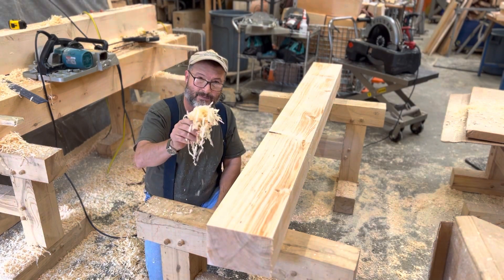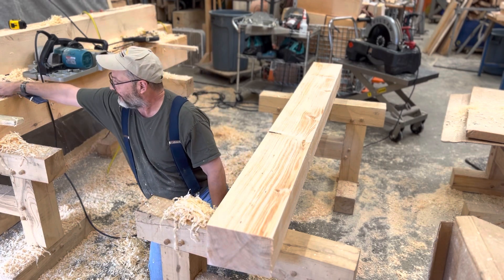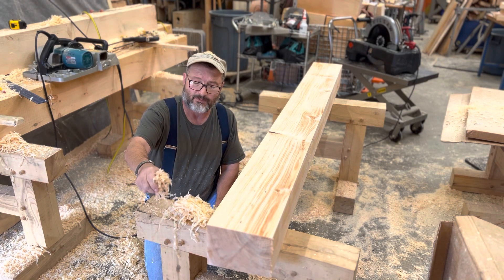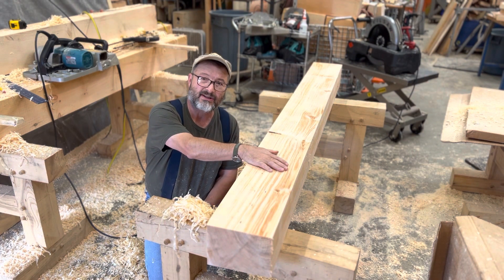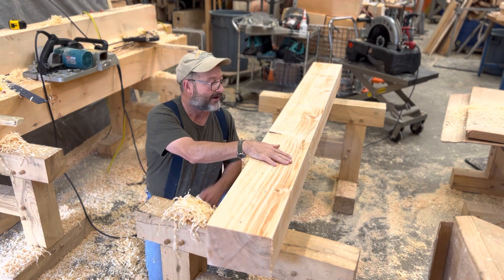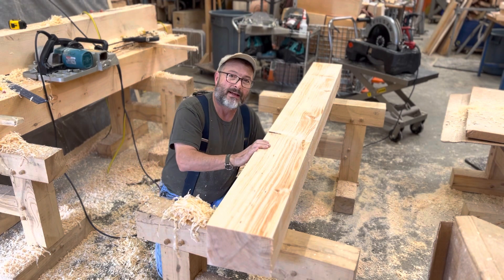This is the size chips that are coming out with the new blades. I grabbed up some of the chips from the old ones — you'll see they're much smaller, much more coarse chips than what I got here. So if you haven't thought about changing out your blades, either changing side to side or putting in the new blades altogether, consider it because this is a perfect finish — a whole lot less sanding to be done on the beam.